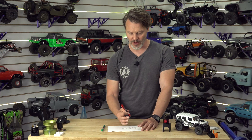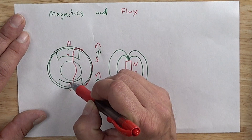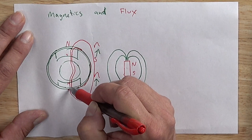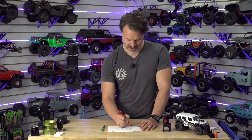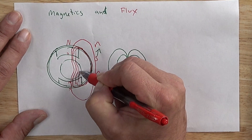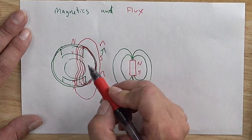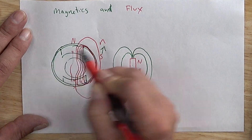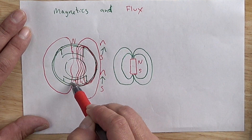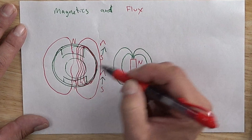When you have a thicker flux ring, you keep more of this on the inside. When our flux escapes into the outside of the motor, it would be flux escaping in the middle. Let's just say that we have saturated our back iron and we don't have a flux ring on there — it's going to escape from the motor like this, it's going to go out into air. And air is actually not a really good conductor of magnetic flux — it's very high reluctance. So these lines are trapped, which is good. They're all staying in the back iron, but our back iron wasn't thick enough and we didn't put a flux ring on it. You can see there's one big old line coming through, and then we would have on the other side the same thing — that is our magnetic saturation point. It escaped outside of the motor because we didn't have a flux ring.